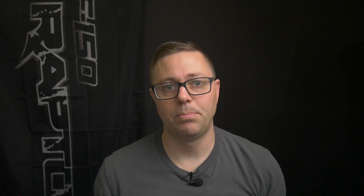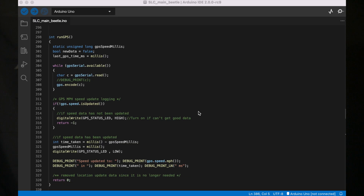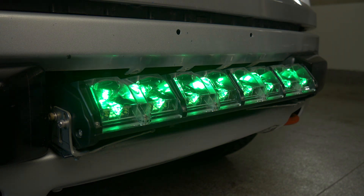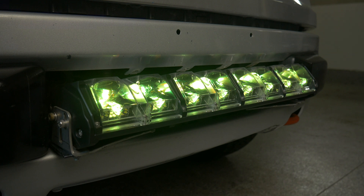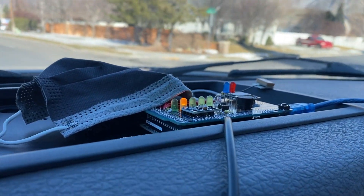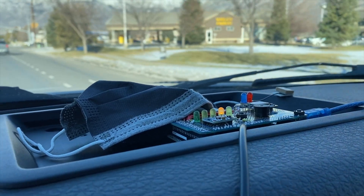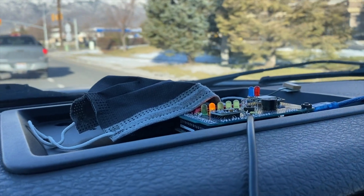I started with a simple, messy breadboard to verify that my controller could actually send a command to the light bar and make it change. Once that worked, I moved to a cleaner prototype. I realized I couldn't drive around the neighborhood with a huge bright light bar — it's not street legal — so I designed six LEDs into the controller representing the six light patterns from full wide to full spot. This let me test during the day, confirming GPS was working and signals were responding correctly.